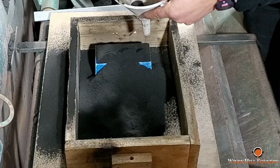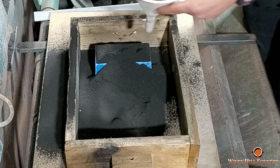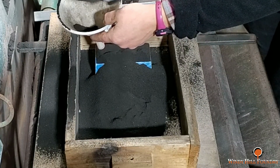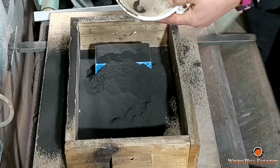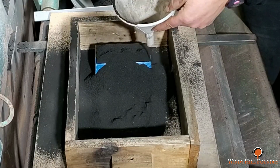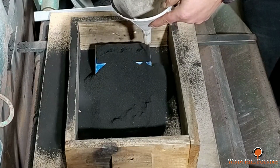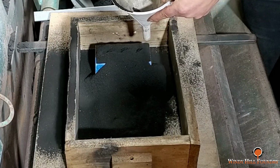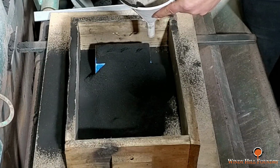Once Laura has this side of the flask molded, she's going to gate it on the left, on the side towards us, to where it's steadily running through the thin sections, keeping that hot as it fills that bigger block down there. That's going to be, what, 10 pounds of iron at least?